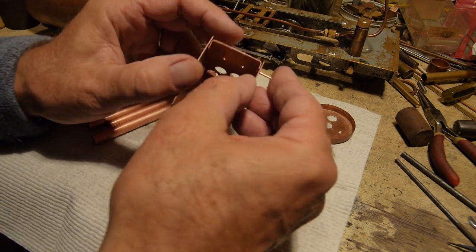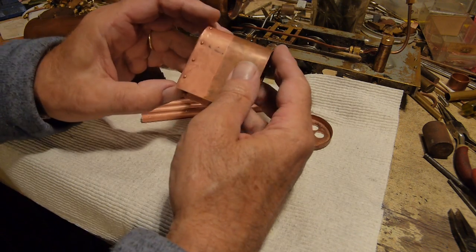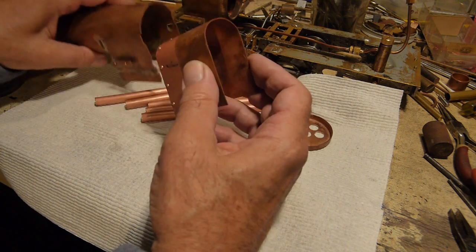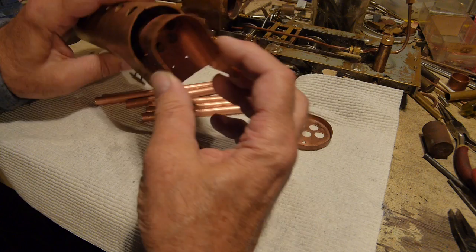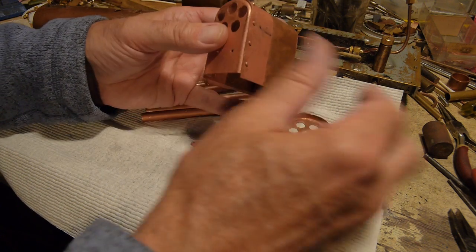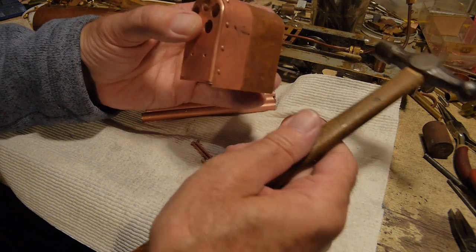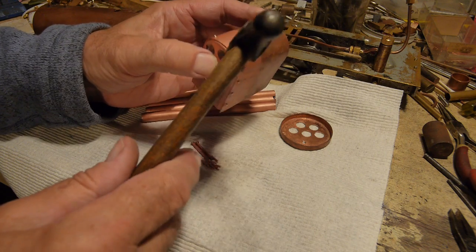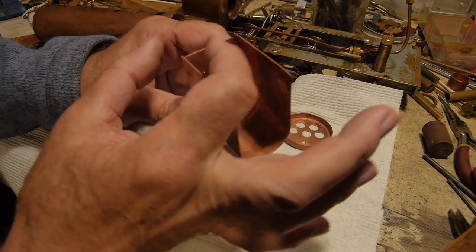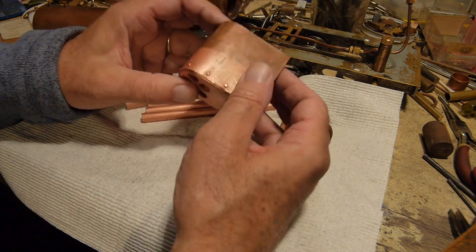First off I'm going to put the rivets in — it's a little bit of a fiddly job. I've now riveted the firebox tube plate onto the firebox inner wrapper, the piece that sits inside the firebox surrounded by water. One of the great things is that you've got to get a fairly close joint here, but the copper is so soft that you can just give it a light tap and it'll bring it into contact with the flange. You can see the flange on the inside here with these little rivets — I probably put too many in, but no matter.